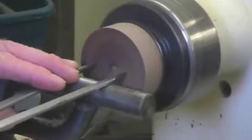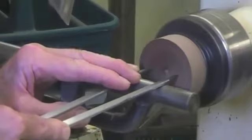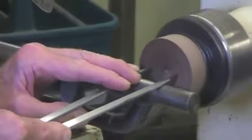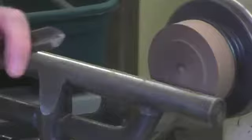You're going to cut a little groove. And a groove that's too big, you move in about half that. Okay. Now that one lines up. I don't know if the camera is able to pick that up. But that second groove lines up with the leg on the right. Okay? So that's the size of the tip that I want to go to. That made the other one bigger, I can do my initial turning right to the bigger size. You can see.